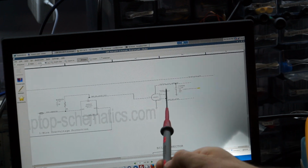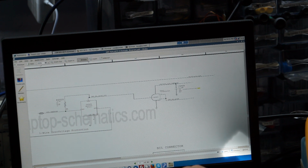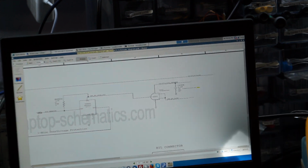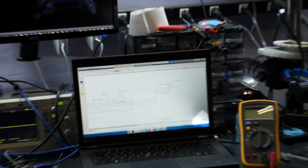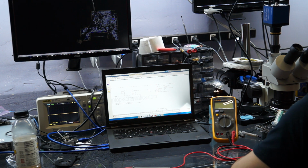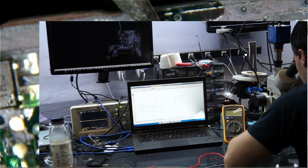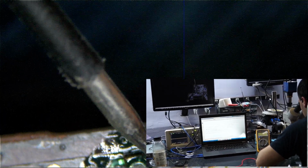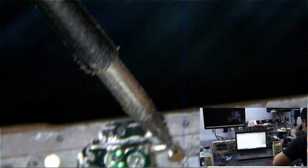If you measure over here, very often you'll find that you don't actually have 3.42 volts. So U6901 is, let me just make sure, now U6901 is this little thingy over here. It's right here. And you can see that actually, even though this one did have 3.42 volts, the probe point for it is really messed up.